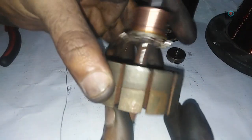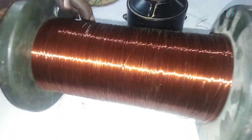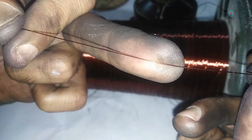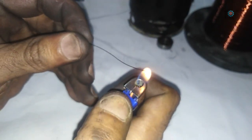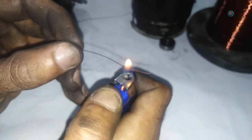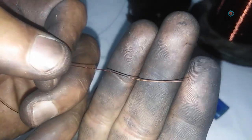The wire has been removed and now I am going to rewind this rotor with wire size SWG 29. Here you can see this wire — the size is SWG 29. Let's start. First of all, remove the insulation from the edge of the wire by burning it like this, and then scratching the wire with your nails. Here you can see the insulation has been removed from the edge of the wire.